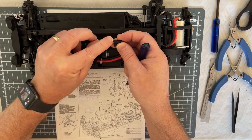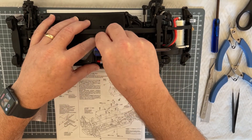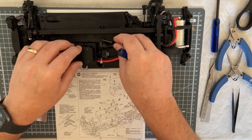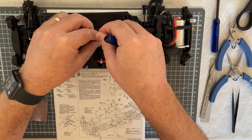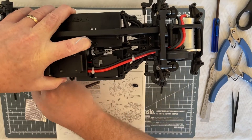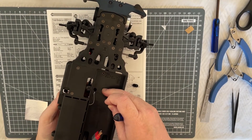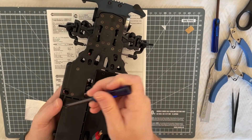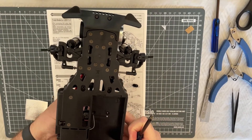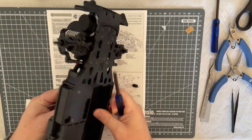Get your JJ4 part and pop the antenna bit through - there's a little key here. Pop it through so the key sits on this side. Then from the underside, we take the BC1 which is the 3x8mm countersunk screw, and from the underside we're going to capture the screw. I've gone with the first hole because it's a shorter aerial tube - remember this kit could have a longer aerial. Pop that in there and screw that down until it all holds.